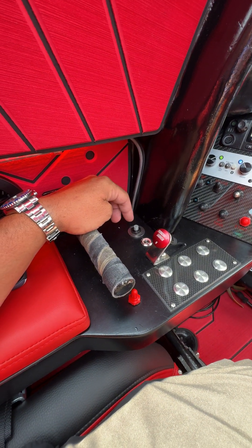Here on the dash we've got our Garmin, so we've got speed and RPMs. Myrick can see the trim, the tunnel tab on the right, drives on the left. I've got the exact same view over here. When this was an actual race boat on a course, the driver could know before going into the corner if the tunnel tab was down — you obviously don't want to go into a sharp corner with the tunnel tab down. Things I'll be watching: fuel pressure, water pressure as we're going down the course, and the biggest thing is trim. I'll be watching the gauges, watching the RPMs, and slowly bringing the trim down by feel and by RPMs.